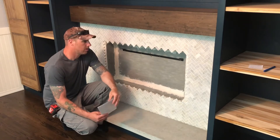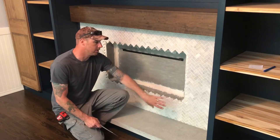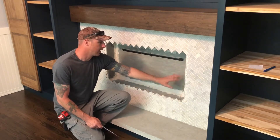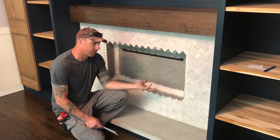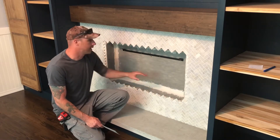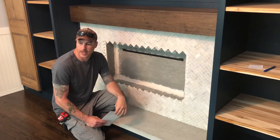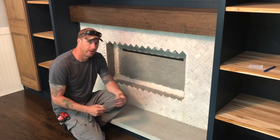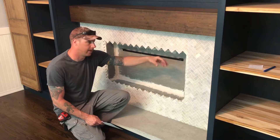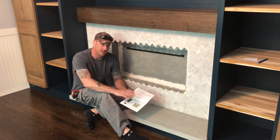Since we're dealing with fire, flame, and heat, they want you to build this out of non-combustible material. It calls for at least metal studs as your frame and cement board or concrete board as your casing on the inside. I also put some thinset or mortar along all the joints, and I have tile on the outside, so everything is pretty much flameproof and in a metal containment.